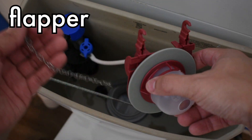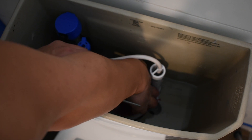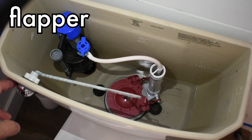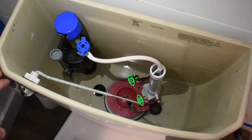Grab the Fluidmaster flapper. This one is cool because you can adjust a lower or higher number to use more or less water. Put the flapper down and snap those hooks onto those arms. Don't break these arms off — you don't want to make matters worse. Make sure it moves appropriately, then attach the chain. You may also need to adjust the chain position so it actually lifts the flapper — this is a bit of a guessing game; I moved it about an inch. Once adjusted, put it back onto the lever and test the movement to make sure it works.